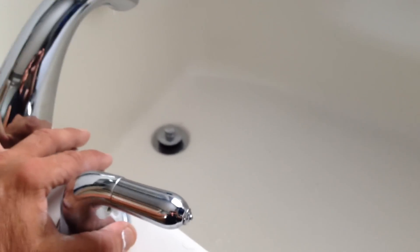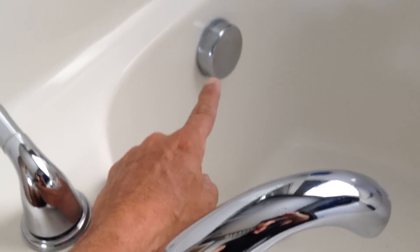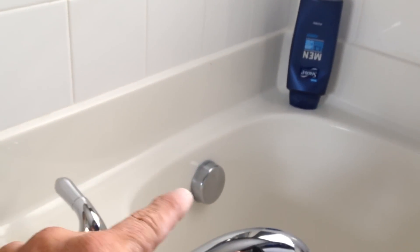Just out of nowhere, another water leak. Here's where it was — the stupidest of all places, you won't believe it. Third floor bathroom. I filled the bathtub up with water, turned all the water on, got the water up to about right here, left the water running, and popped the plug, then ran back downstairs to see where the water was leaking. Well, guess what — there was no leak anywhere. Guess where it was? The drain valve. I removed the drain valve and it was leaking around the edge, going in behind the tub and dripping straight down.